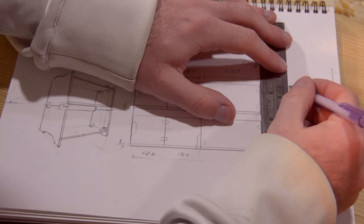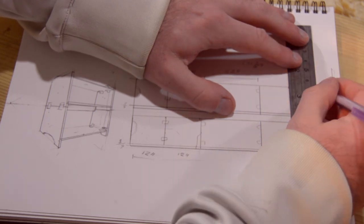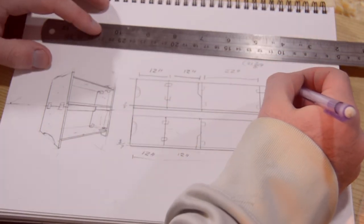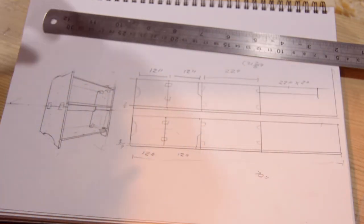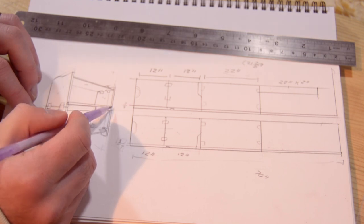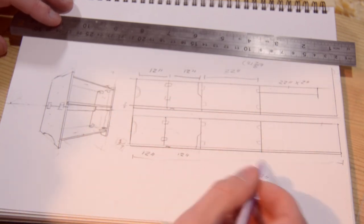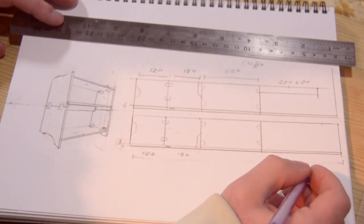If I had just bought a 9.5-inch board or a 9-inch board, this is how I would have done it. I made my only 2 inches, which is close enough, so it's 22 inches by 2 inches. The dado I have is 3-eighths, which means the matching dado is also 3-eighths — that adds up to 3-fourths. My boards are 22 inches wide, which means this one, to fit into these dados and look clean, needs to be 22 and 3-fourths.